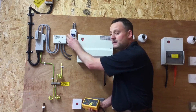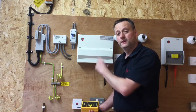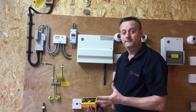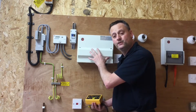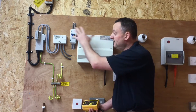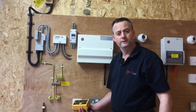If the switch is located in an outside meter cupboard or away from the distribution board, I don't recommend using it to isolate at this stage. The problem is if you turn it off there and take off the cover, you've then got to go outside and turn it back on again — leaving the consumer unit with the cover off, which is not acceptable. Instead, use the main switch or the double pole switch inserted within the tails before doing the test.